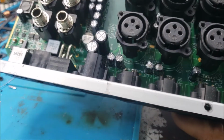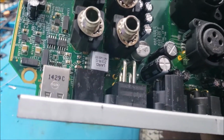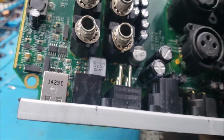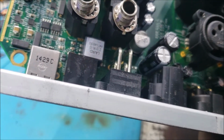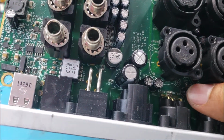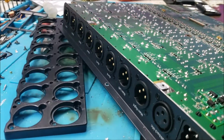And clearly those capacitors were facing overheat, and the oil inside them got hot, and now the capacitor is dry. I'm pretty sure the ESR in these capacitors is so high. So after we remove them, we're gonna check the ESR and we'll go from there. So these two capacitors here, we're gonna replace them with better capacitors.